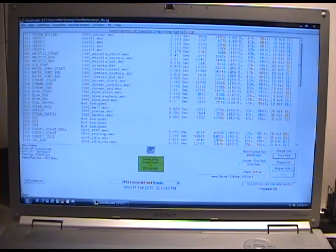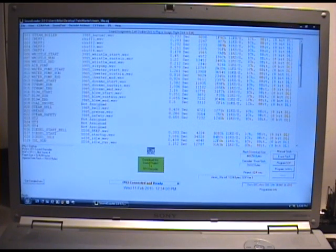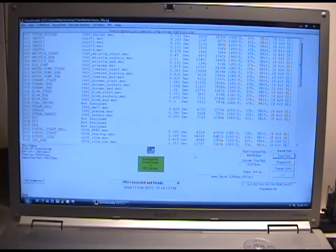The SoundLoader software is a very handy tool in not only programming but testing the locomotive. The main toolbar has most of the functions, and expanded versions of those are all in the article, but we're going to start off with a brand new install on the decoder. And the first thing we want to do on the programming track, much lower power setting, less chance for frying it, is let's make sure that we were successful in getting the install.